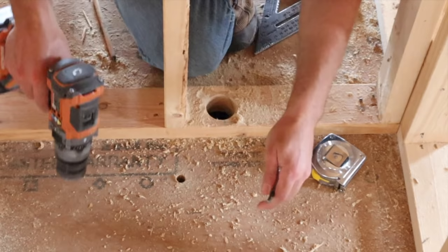The vent pipe runs up to the roof and exits the house — don't forget the quarter-turn when gluing. The sink vent and toilet vent tie together up top into one pipe, which also catches the laundry room washing machine vent, and then connects to the main stack. The main stack continues up, collects a couple more pipes from the master bath, and exits through the roof. That's how you vent your bathroom. For pressure lines, each hole drilled through the floor gets a supply line — hot on the left, cold on the right. The shower gets a mixer valve, which I'll cover in a future video.